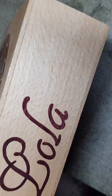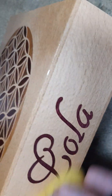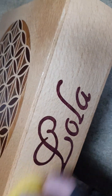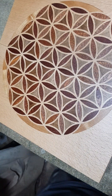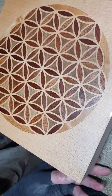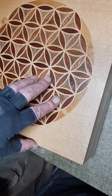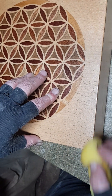You can put Purple Heart in the oven — ten minutes at about 80 degrees — and it will make it go a little bit more purple. Purple Heart's quite a funny wood in as much as when you cut it, it's brown, and then it oxidises. Daylight, sunlight, oxygen — it oxidises and the purple coloration comes out more.